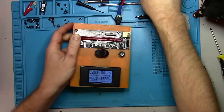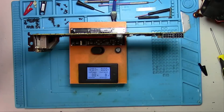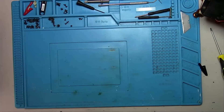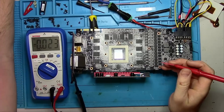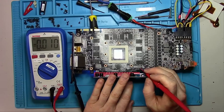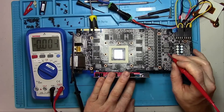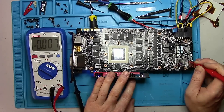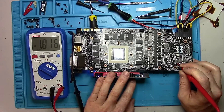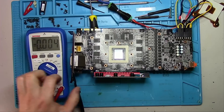So let's power it on and see how hungry it is. It looks like just under 2 amps, which means something is wrong with the GPU power phase. We'll look into that later. Next we check if the board has all the power it needs to function. Since we have 1V and PEX, that means we have V-core and memory, which automatically means we have both 5V and 1.8V. So there's no reason why we can't plug it in and see what's going on.